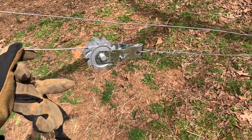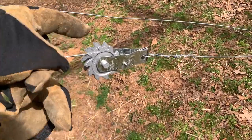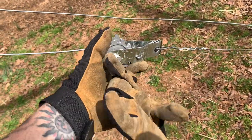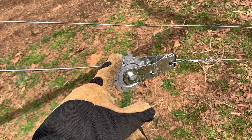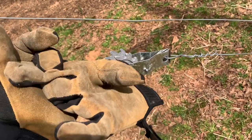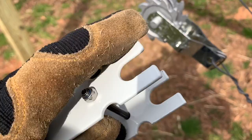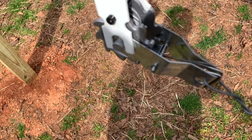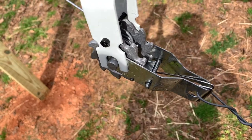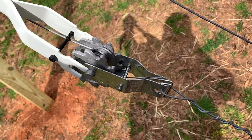What we've got set up here is called a ratchet strainer. We've got our high-tension wire around the bottom of our corner posts and the top of this last post. You sneak your wire through here, tie it off at the end, and just tighten down on this buckle. They have a tool — kind of like a fork — that you can ratchet when it gets tight. It's notched on both ends, slips over the end sticking out, and this bolt comes down and catches the sprockets on the ratchet. You just crank it down and it takes a lot of the hard work off your fingers.